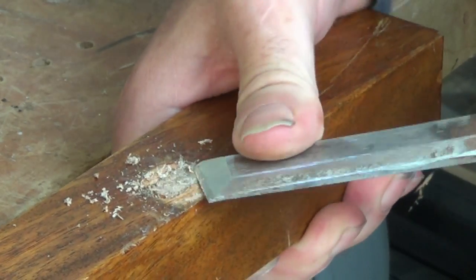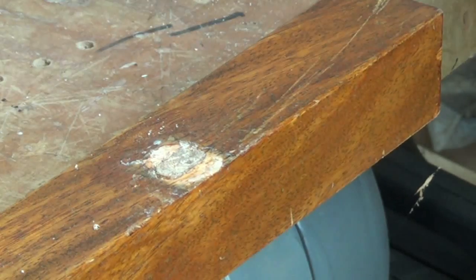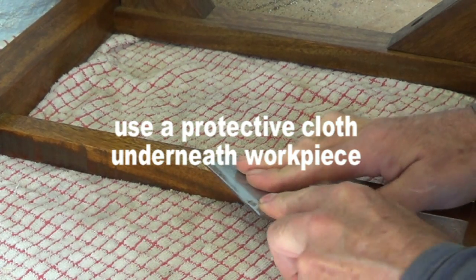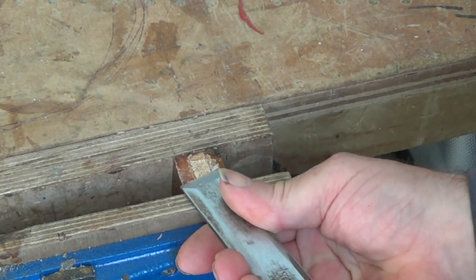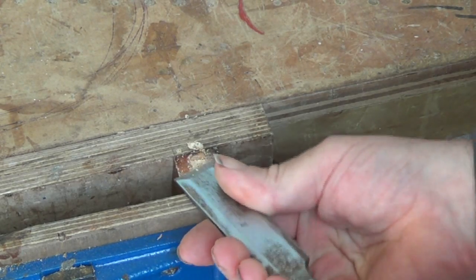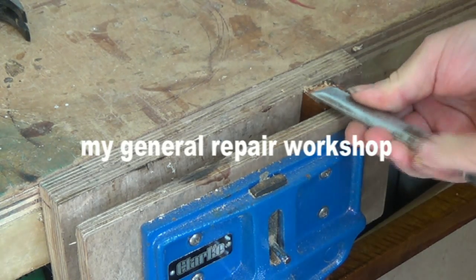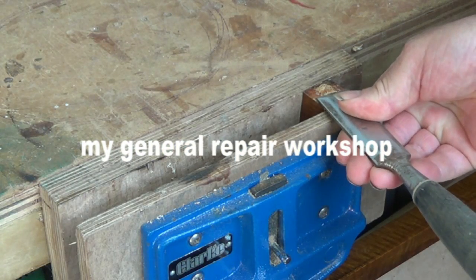to do this repair. First, I cleaned up the broken dowel joints on the various pieces. Note the importance of chisel control. Forget about my rusty chisel and focus on what the fingers and thumb are doing to control the chisel. A slicing action using the thumb to exert the pressure is shown here. The rails are placed in the vise with ends flush, and a careful slicing action continued with the firm finger support to stop the chisel splitting end grain fibres.